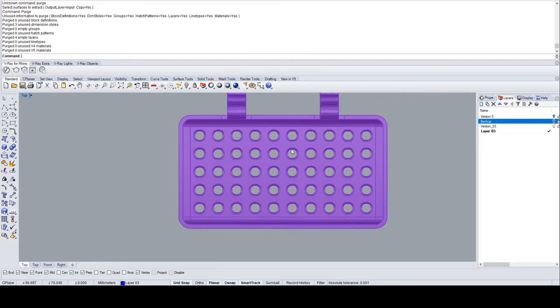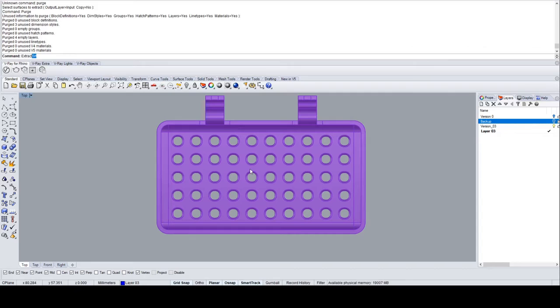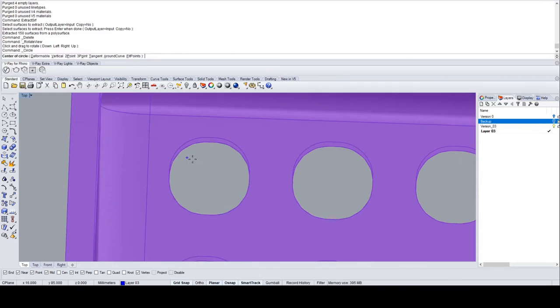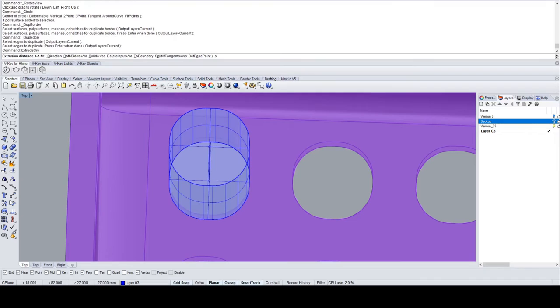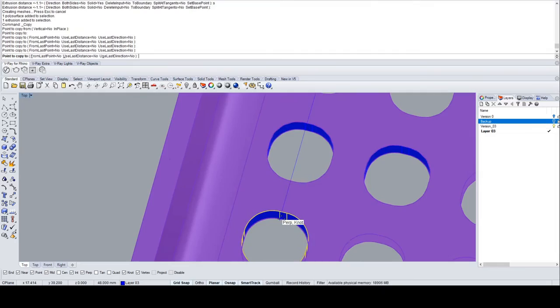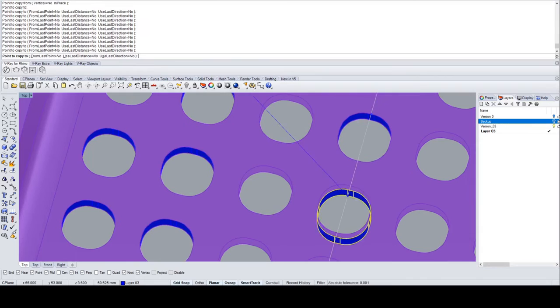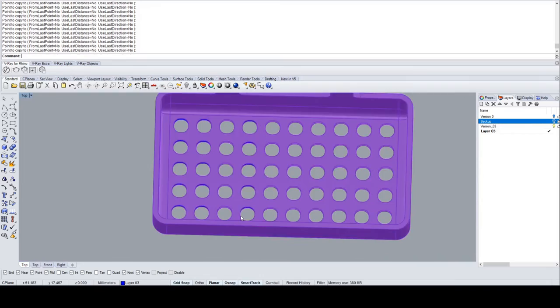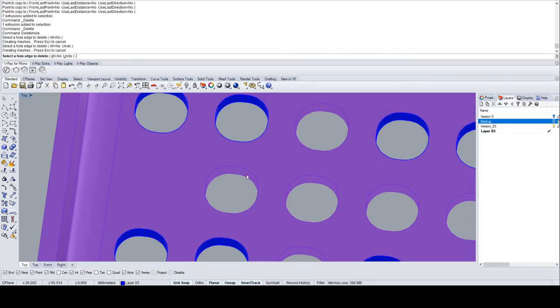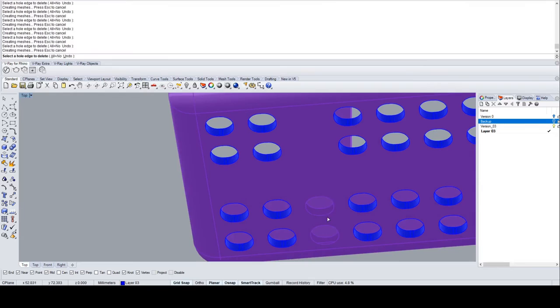I actually went back to the version with the holes, just because it looked better. What I did though, I just took out the fillets, which I thought might be the reason why it takes so long to print, and also realized that all these fillets were completely for nothing, because with the certain thickness of the nozzle, you already have some kind of rounded edges anyway. Also, I decided to take some of the holes out, just to lower the printing time.